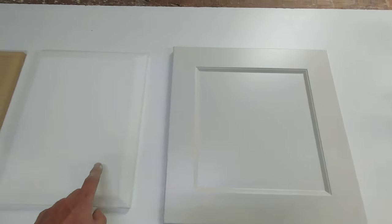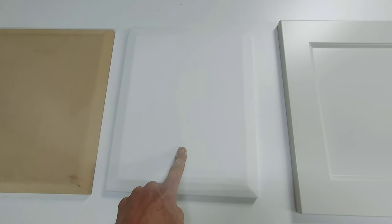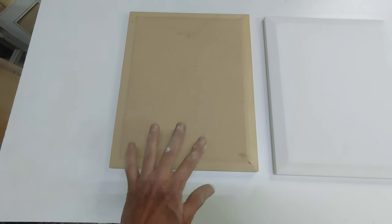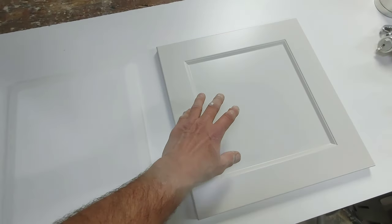By the time you've got your fourth coat done, everything is fine — two primer and two top coat. This is your primer coat right here, two on the face and one on the back. And this is a raw door right here — raw MDF, hasn't been sanded yet — but it gives you an idea of what the stage is from here to here to here.